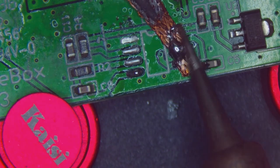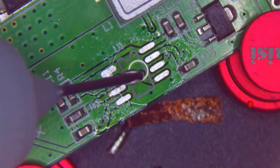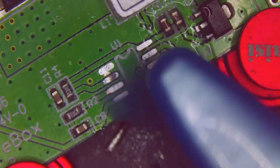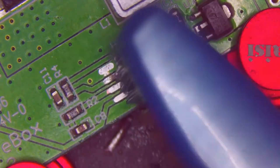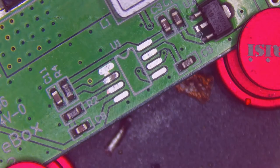It was a lot more frustrating to get it off the part if you're reusing the IC. Make sure you use the minimum amount of that stuff that you can. Then I just clean the pads off with some isopropyl to get them ready to accept the part off the good board.